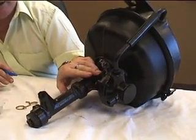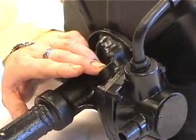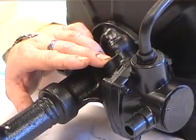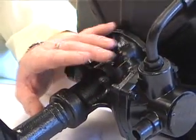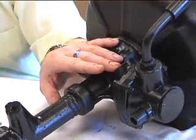The next line is the supply line. That supply line requires a minimum of 16 inches of vacuum to drive a unit this size — 16 minimum, and more the merrier: 20, 21, 22, whatever you can get. Depending on your elevation from sea level, vacuum will vary a little bit, but for the most part, 16 inches minimum.